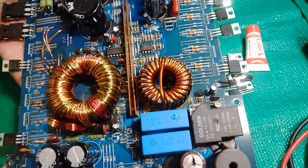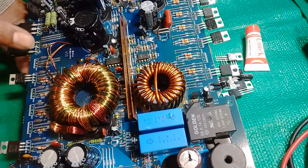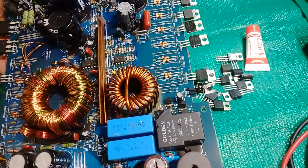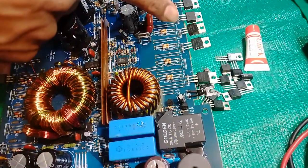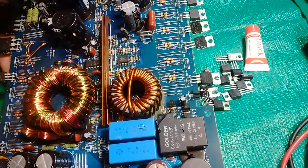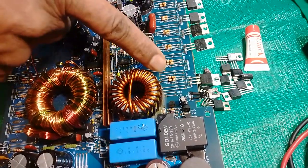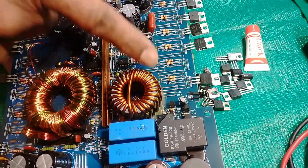So in this case, this MOSFET took out 6 of them on the power 12 volt rails, and your upper IRF9640 and 640, I found only one each was open. All of the rest of them are genuinely working MOSFETs. I repeat again, the genuine MOSFETs are working units.